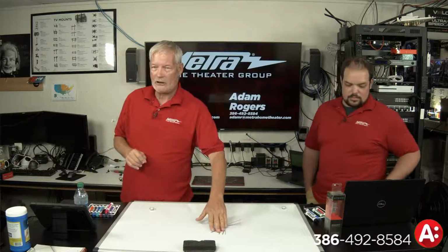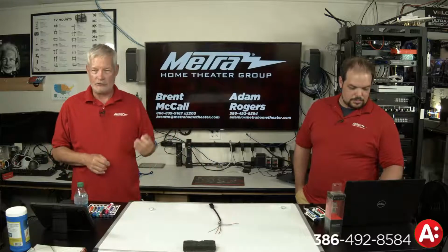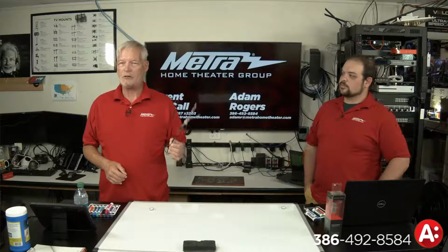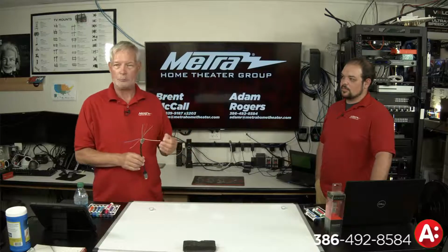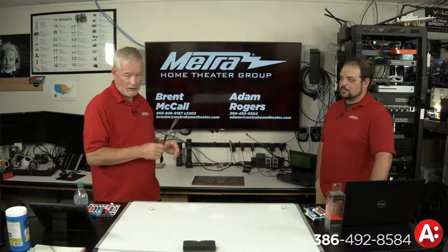Each of these channels has 3 conductors in it, as we just discussed: RX, TX, and ground. Each of these channels transmits a high-bandwidth data signal. Now, under the current rules, it's 6 gigabits per channel. R, G, and B, that's how we get to 18. Right, 6 plus 6 plus 6.